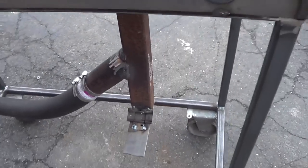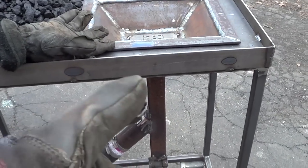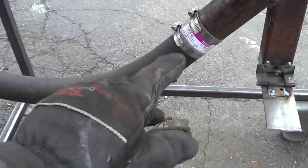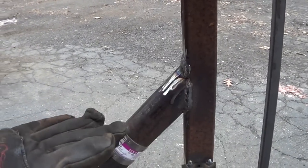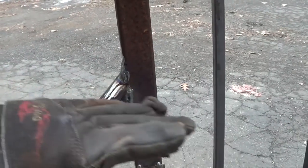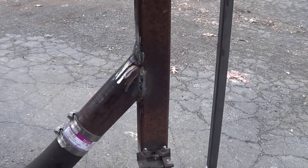And there, I believe it's your tuyere, which I believe is pretty much the whole air system here, if I'm pronouncing that right. So I got my intake pipe, or my air outlet pipe from the blower, and I put it up on an upward angle like that. That way I can hopefully increase the efficiency of the airflow. If you mount it on a 90, then it hits against the side as opposed to going up gently. That's why I did it on the 45-degree upward slant there.